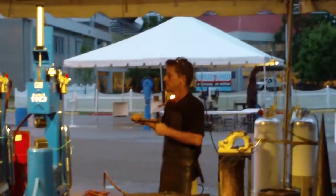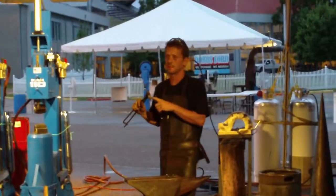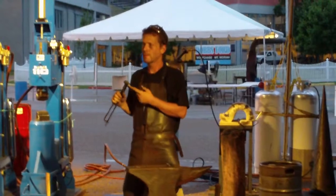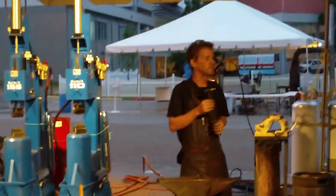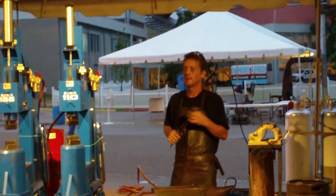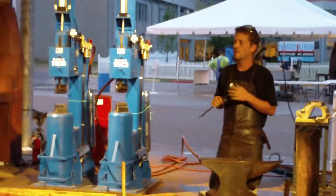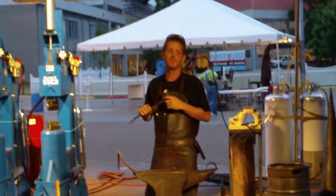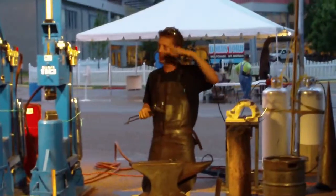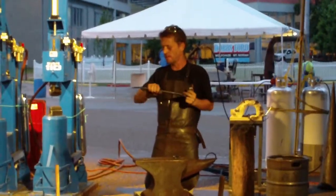Now again we are going to use this hot cut — H13, excellent hot cut. You don't need to heat with it. The moment it is coming out from the fire it is air hardening, it will get hard. Very very important with H13: not to overcook it, not to leave it too long in the forge, not to raise the temperature too high.